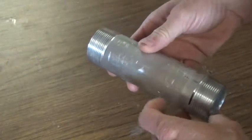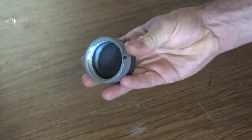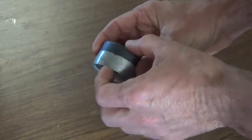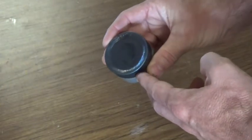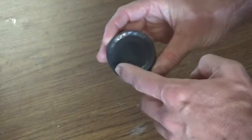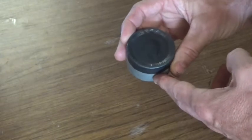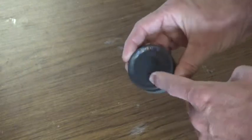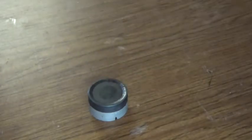Each of the fuel cells will be three-and-a-quarter inches long. Next, we have the cap piece. This was made from an inch-and-a-half steel pipe coupling, cut down to size to fit well onto our pipe nipple. I cut out a round piece of three-sixteenths-inch steel and welded that into the cap assembly. You'll note we don't have any location here for a delay grain or ejection charge — we don't use an ejection charge off of our motor. Instead, we use an ejection charge system based off of an Apogee detection circuit.